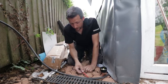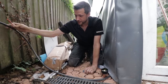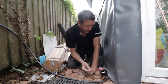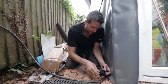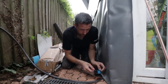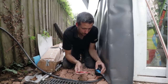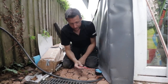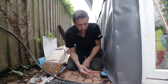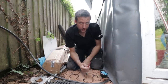I've deliberately left some slack in the armoured cable here because the customer needs to finish the ground. You can buy earth boxes like this but I've just used a 20 mil junction box with a weatherproof gasket - literally made it myself for about a quarter of the price. It's just a 20 mil junction box with a bit of Copex and a safety electrical connection tag on it.